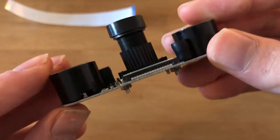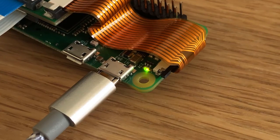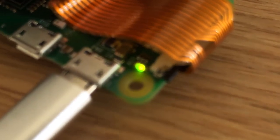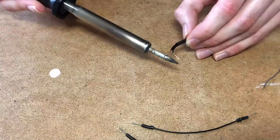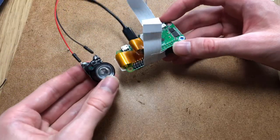So I was almost back to square one. I had a good camera that worked at night time, but couldn't function in parallel with the colour camera. But I also had the other NoIR camera, which just couldn't work at night time, but could work in parallel. So I had a bit of a think, and I realised that I'm not limited just by the existing parts I already have — I could splice things together. I knew that the Raspberry Pi Zero was able to output a decent amount of current on its USB port, because there's no limiting whatever between it and your power source. So I took off one of the IR LEDs from this new camera, spliced together a USB cable, and soldered them directly to the LED, then plugged it into the USB port. And this actually worked, which made me very happy.